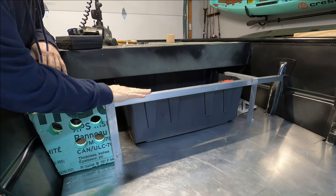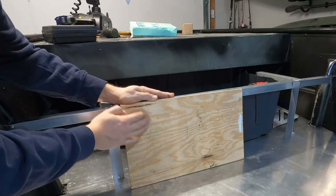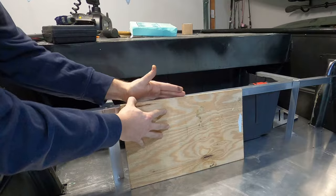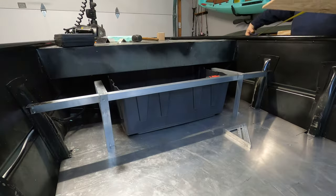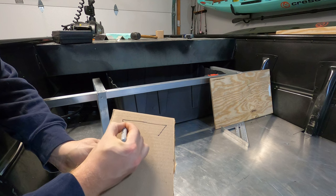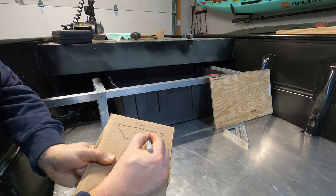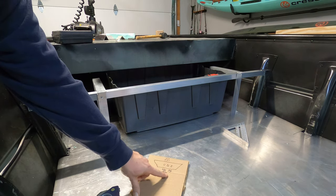The first thing I want to work on is getting this front bench paneled — I need a face panel and then a top panel. The height of this front panel needs to be at least the thickness of this piece of wood over the top brace, so when the other piece of wood sits down, these two things meet flush. It's 53 inches wide by 11 and 7/8 tall — a trapezoid shape coming across and then slanting down on each side. 53 inches in width, 11 and 7/8 in height, 48 and 3/4 on the bottom. Let's get this marked out on a piece of plywood and get this cut.